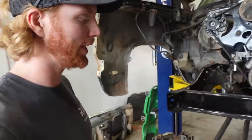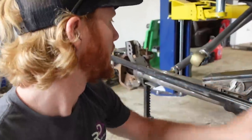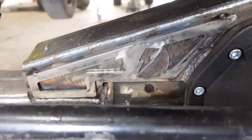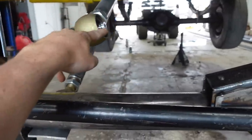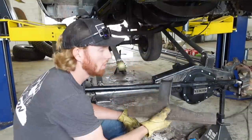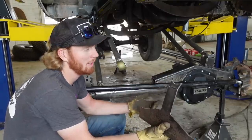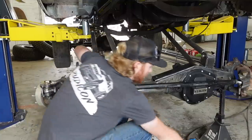Good morning. I left you last night with just the truss being built, but I got this upper mount design cut out and tacked on — super basic, but I did add some design detail. I got the temporary mount cut off of this side so it's just hanging down, but we need to build something that comes up and attaches it at the same level as the other one. My idea was to tie across all the way — I didn't want a truss on this axle, but when you have upper link mounts it just makes sense. Let me get that tacked in.